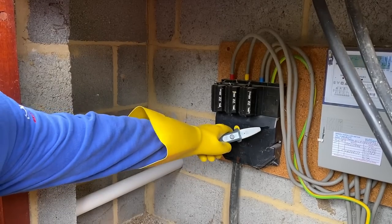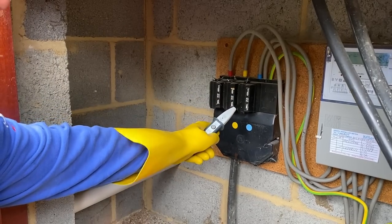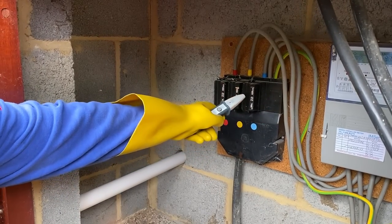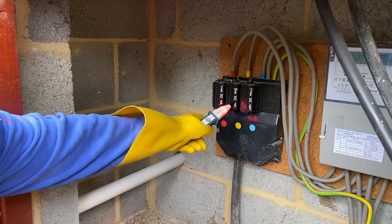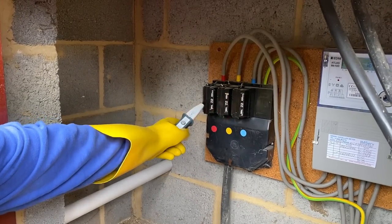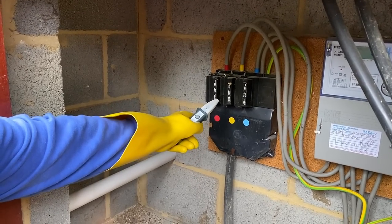Let's see — I've checked. So that's nothing? Nothing at all. So there we go — oh dear. So what's that suggestion to me? We've got surface voltage. So if I was to grab those fuses and pull them out, we don't actually know how many volts could be present on the insulator. That's right. So hence the rubber glove, and you said that's a contact voltage.